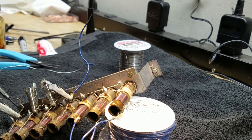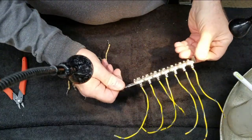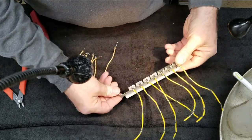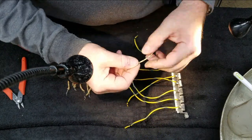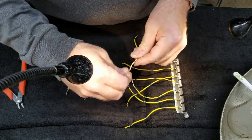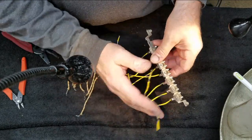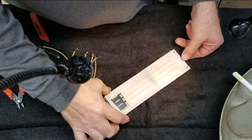I'm getting this station preset lineup of trimmer caps ready. There wasn't much to do except clean the thing off and replace the wires, because these wires - even though they look cool - are getting kind of crunchy. They're stranded wire and they're not real flexible; it's real crunchy inside that black insulation underneath this cloth. I need to be able to bend these wires when I'm setting this thing up, so I just put some new wire on. This thing is ready to go.